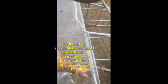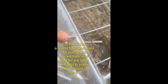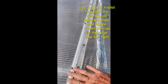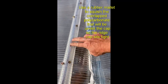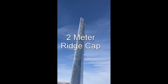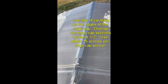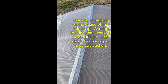Back on top — you're overlapping a little bit and you can screw it down without the washers because you're going to have a ridge cap over the top, so it doesn't matter if you squish it down since there's no UV degradation. Squish that down before you put the ridge on. The ridge cap is pretty good quality material; I take scrap and put it on either side of the ridge beam to give more meat, which allows me to bolt it in better.